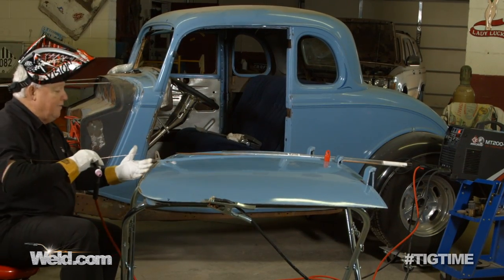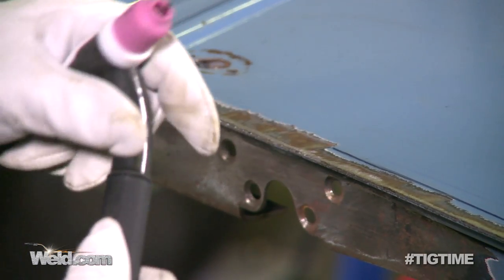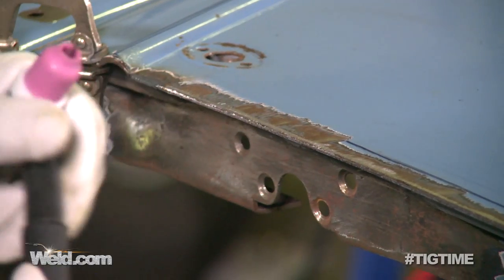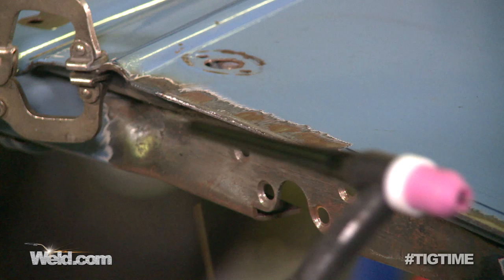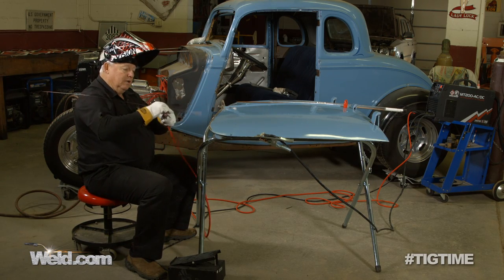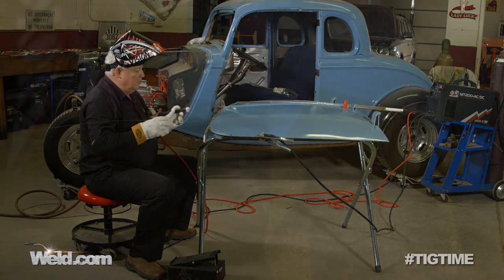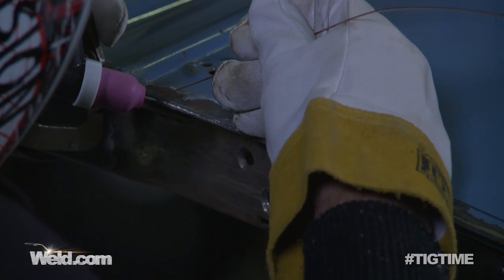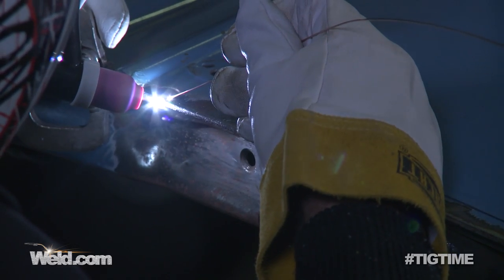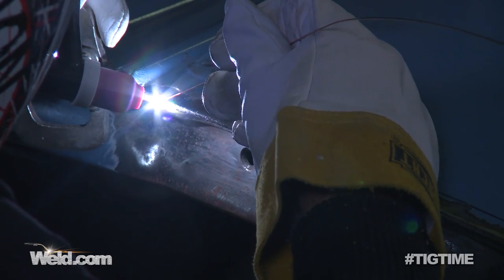It's always a good idea to have a hand rest. Now I've got a flex head torch, and it comes with this machine already — kudos to CK Worldwide for coming up with this. I can position it any way that I want. It's a 150 amp torch, air cooled, super flexible cable, so I can maneuver and never get tied up with my wrist. I just took a little vice clamp and I use that as a rest, and I'll keep repositioning that as I make my weld.